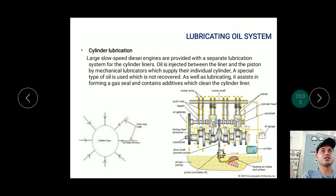The cylinder lube oil contains additives including a Total Base Number (TBN) component that neutralizes the acidity in the combustion chamber. Combustion creates an acidic environment with various chemicals, and without neutralization, that acidity can corrode metal parts including those near the exhaust valve and turbocharger.